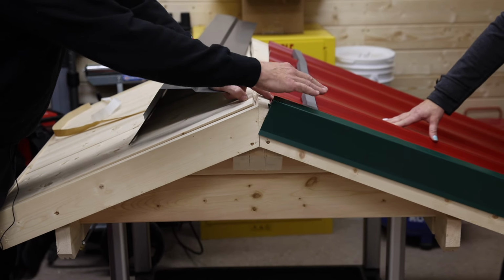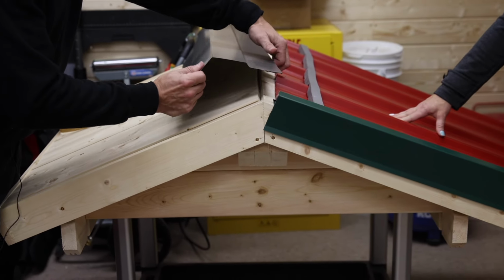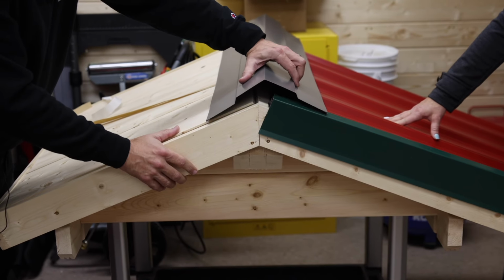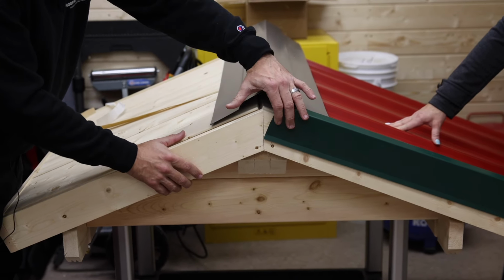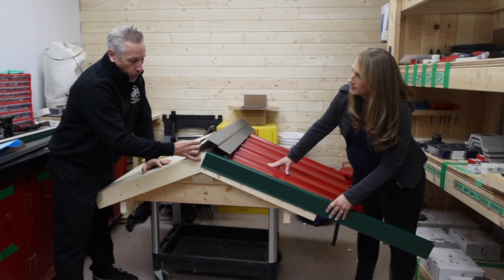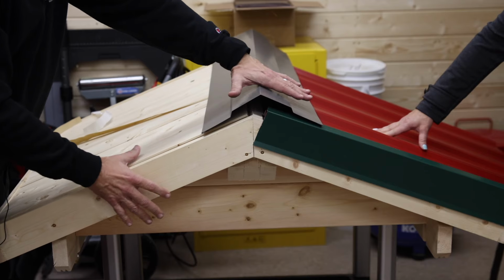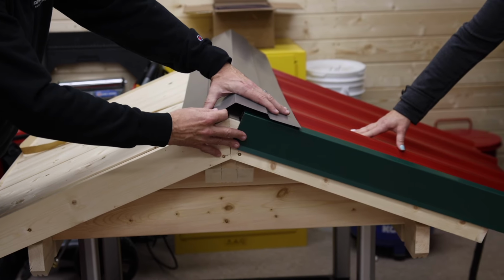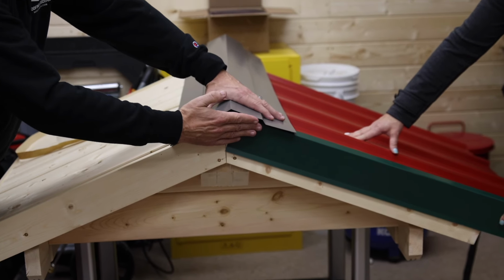the sheet's in, this is on, you're putting the cap on now. People ask, does the cap sit on the edge? Do I tuck it in? And the answer to your question is, we want better rain off. So having it on top, and when it's pushed down, it is a slight edge there. That can be left over top, cut and folded down to meet the edge of it.